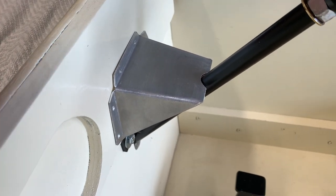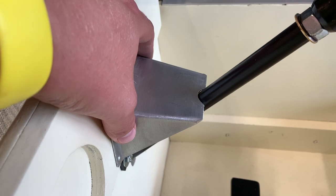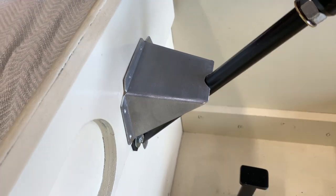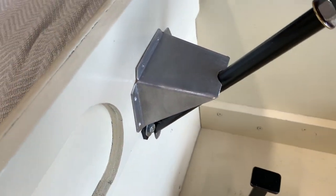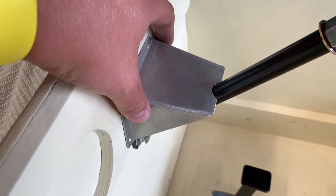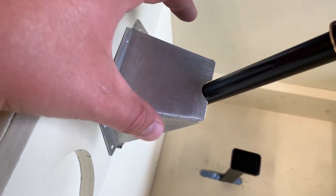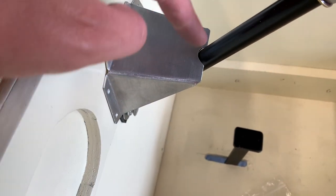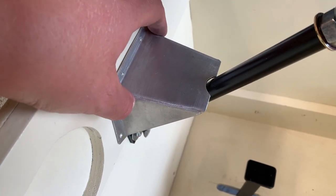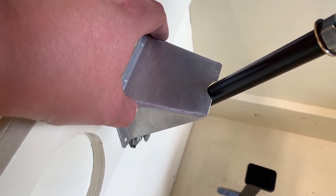This is the little change I was talking about with regards to the steering nacelle. It's not necessarily as per the plans, but looking at original Land Rovers, these little steering covers were clamped around the column to hide this bit underneath, which isn't really the most attractive. So I've notched this — marked it out around a washer of similar diameter to the column and filed out a notch — so it will sit slightly back and not mark the paint.